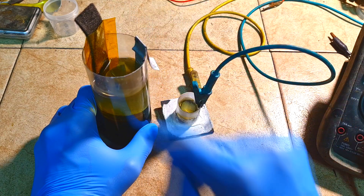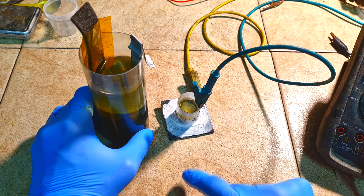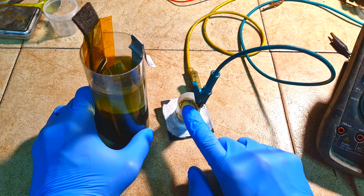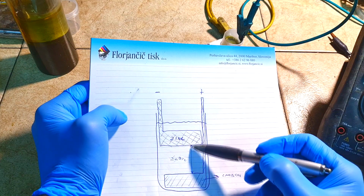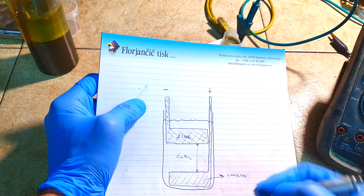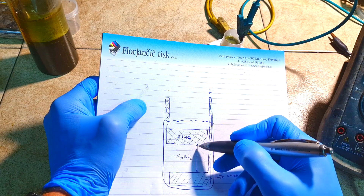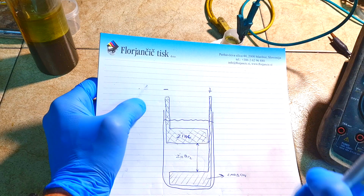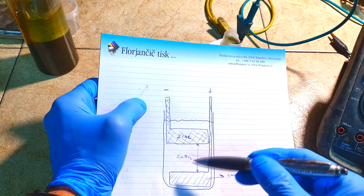This little one has better output power and the charging and discharging efficiency is much greater. The problem is because of the greater distance between the positive and the negative electrode in the basic zinc bromide gravity battery construction. Greater is the distance between the positive and the negative electrode, much higher will be also the inner resistance of the cell.